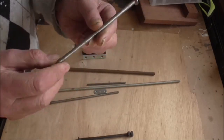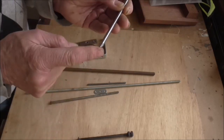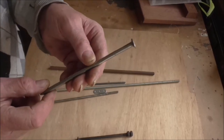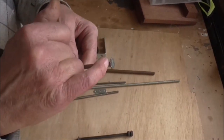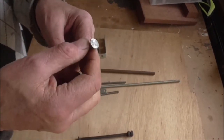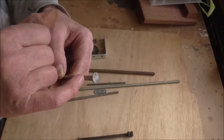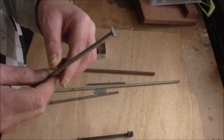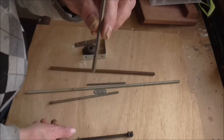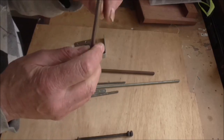You've got the six inch nail, and they're very useful because it's about the right size — good and strong with a sharp point on the end. People use these in different ways. What I do is chop the head off and use the point to bash it into the pole, then find a method of fixing the thing on — you could drill a hole through, or if you've got a tap and die set, just tap a thread on the end and use a normal nut. You could also just put a hole through the whirly gig and bash the nail through and into the pole, but you'd have a job taking it off again.